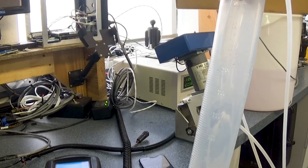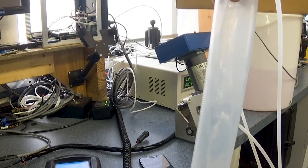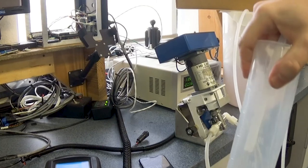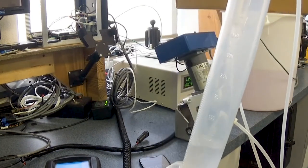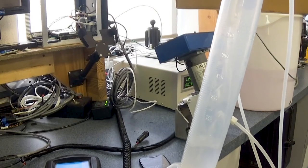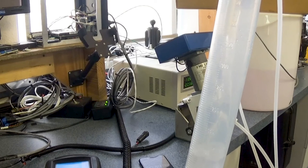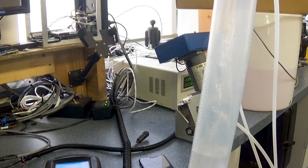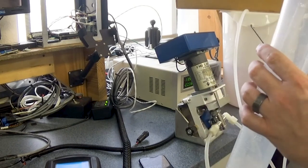So right here we're probably going to get something like 4 ounces a minute or whatever. And whatever that ends up being, that's the minimum that pump's going to be able to do reliably in a given calibration. But if we're spraying at 8 ounces a minute at 10 mile an hour, and we got our cutoff speed at 5 mile an hour for our low end, that's 4 ounces a minute. So that's within spec, we'll be doing good. All right, we're about to come up here on a minute.